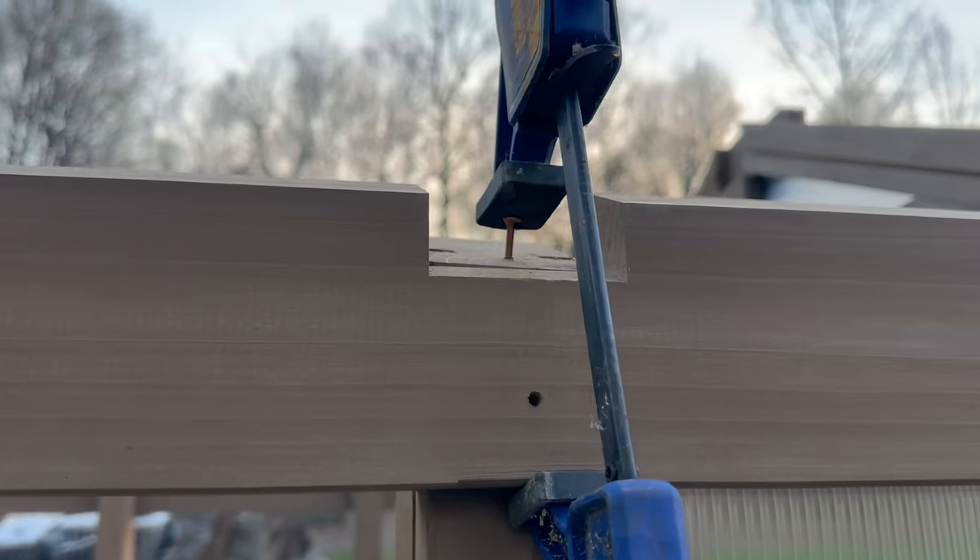Here's another view from this side with the vent window in it. Each rafter end has screws going into the top plate all the way down. The next step is putting the hinge on the inside for the automatic opener — the instructions say you have to put part of it in the refrigerator for seven minutes to cool it down so you can get it together. It looks like rain is coming so we'll call it quits for today — probably pick this up Saturday since Friday looks like a washout. All in all we've probably got about three to four hours into this thing over the last few days.